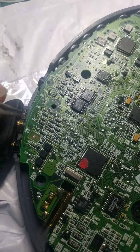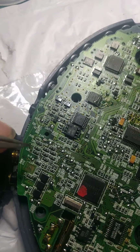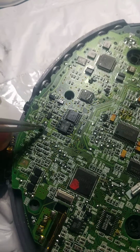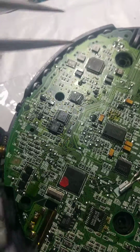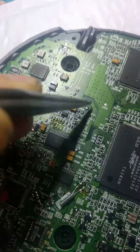to be the headphone right. It's labeled there. Some nice labeling here. Here's your antenna. Here's a left out L, and here's line out L and line out R, so those are 2 good points to test from. And you can grab a ground from almost anywhere. I think there's one over here. Here's an analog ground that's really easy, not near anything.